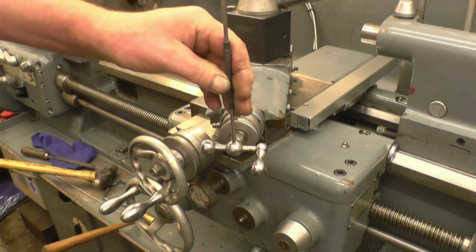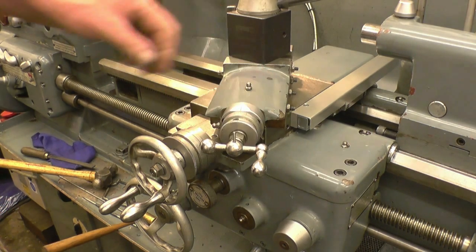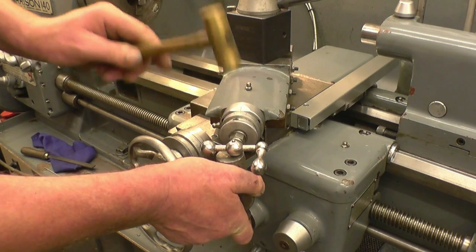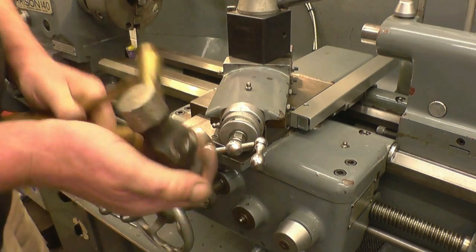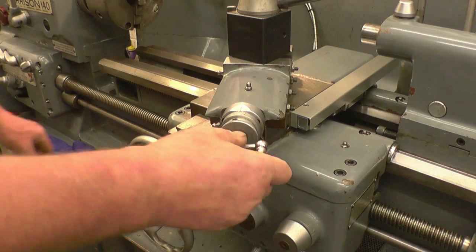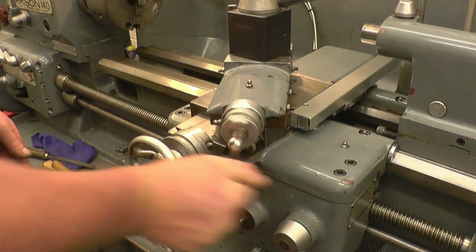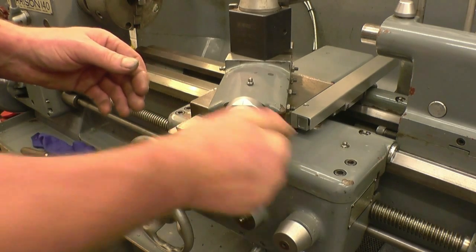It's nicely lined up there with the taper off our spray bar. Pin goes in, small end down. So you support the bottom of the handle before you knock the pin in, just to take any load off the spindle. That's all it needs. Much better now than the horrible flaky chrome. Chances are now when I'm tidying up I will find the pin I lost.